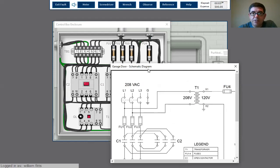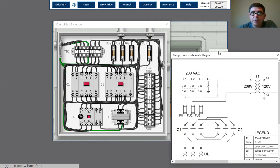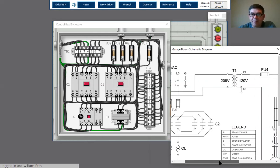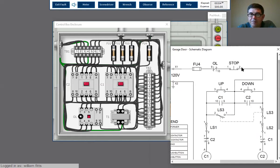Of course it's going to be in the down contact side. Let's look at our schematic diagram — best way to do this is to print out these schematics so you have them. Here's the down button — it comes off the stop, power comes into either the up or the down, and through the down it goes to C2. C2 will drive it down. What holds it in when you push it is the C2 contact, between 9 and 10. My guess is probably a bad auxiliary contact or a bad connection there.